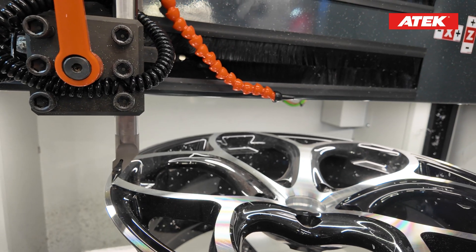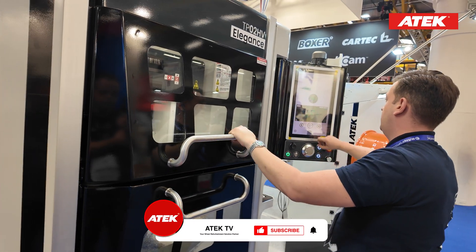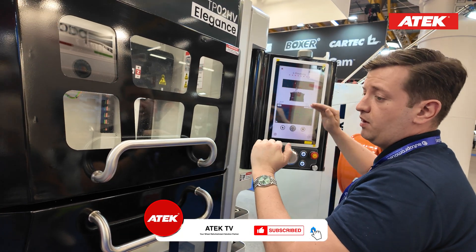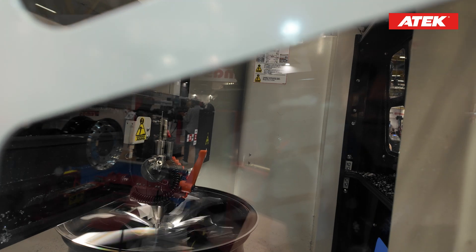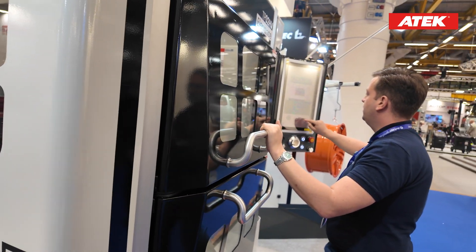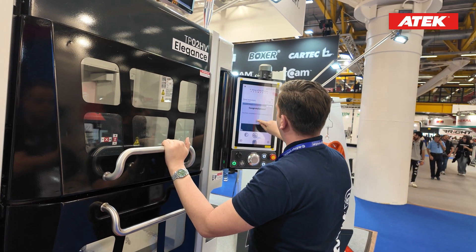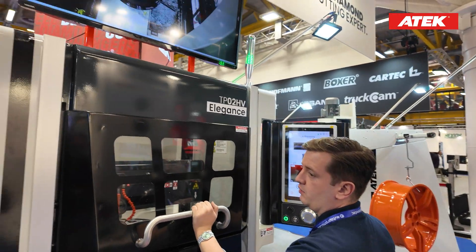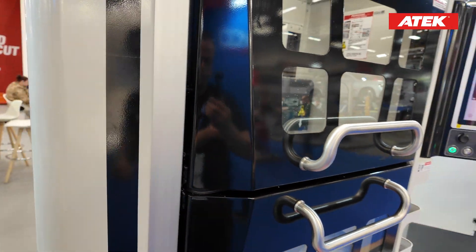I don't need to finish the simulation — I can stop wherever I want. When ready, I close the door and adjust my air nozzle. Because I am starting at minus 0.1 millimeter I am assuming it won't touch the wheel yet, then I'll increase the depth. Now nearly touching — I can go back to settings, set 0.1 millimeter deep. This will be the safe cut, and now it starts to cut.